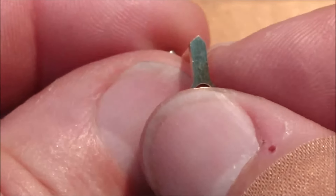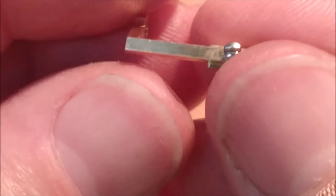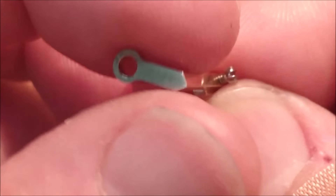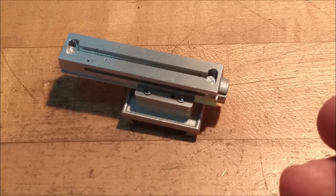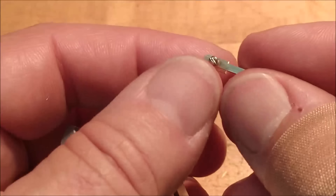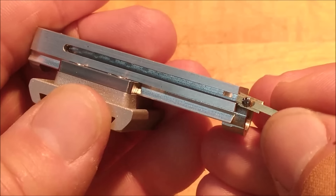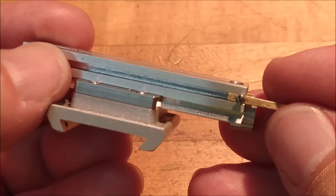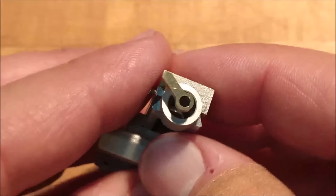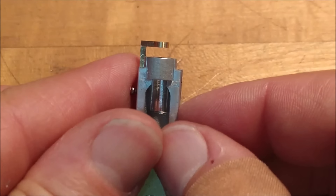Let's take a look at the final product. The symmetry on the end is pretty good. The rounds look good. The exposed surfaces I filed and polished out, so anything with high visibility has been cleaned up. Now this little screw is not intended to trap this device — it fits right in the slot in the front. It traps a rod that goes down to another T-nut, and when the table moves, this thing moves and disengages the gear on the end. You can see that the concentricity of the features is relatively important — there is a shaft and slider assembly that goes in there and telescopes in and out as it functions.